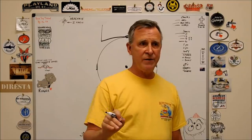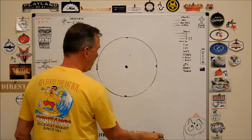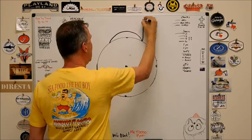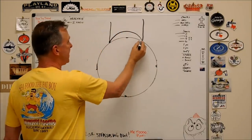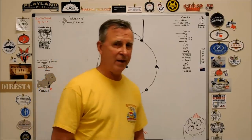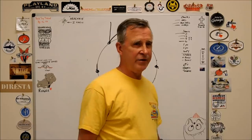on your soft jaws than the part, because quite the opposite then takes place. Now, grossly exaggerated, of course, but this is what you're looking at. All right, got it. Now what do you got? You got 2 points of contact. So when you look around the perimeter of that part, you've got 6 points of contact. 120 degree jaws give you 60 degree contact points. Can't get any better than that. Ideal, congruent, identical contact. Chances are it's not going to happen.